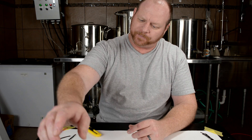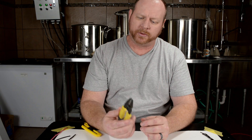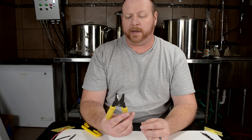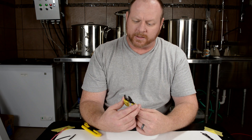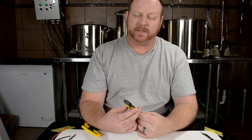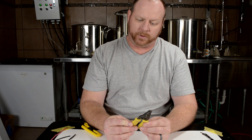The next one is a true pair of wire strippers, which these are made by Klein and you can find these at Home Depot, Lowe's, any place like that. So these go from 18 all the way up to 10 gauge — that's definitely a good tool for doing the wire stripping.